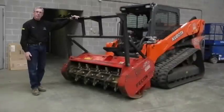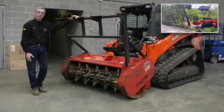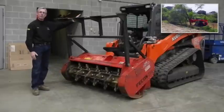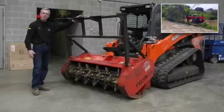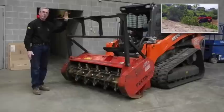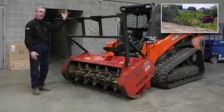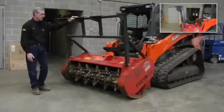This rack up on the top here is a push plate or push bar. It is used to control the tree as you're grinding it down — you can have it captured in between so it doesn't fall one way or another. If you're trying to keep it from falling onto some sensitive areas, you can steer it as the tree weakens. You can turn it one way or the other, or control it from falling back on you by pushing it away from you.